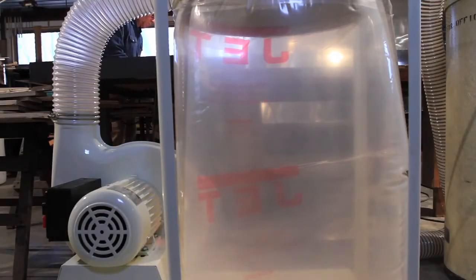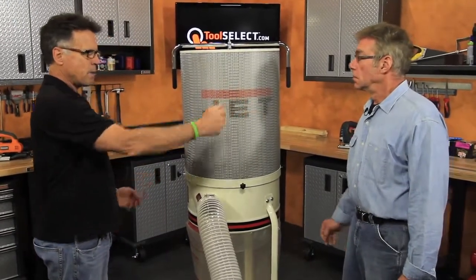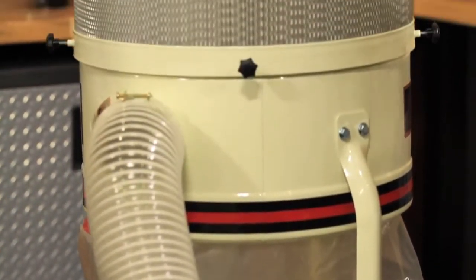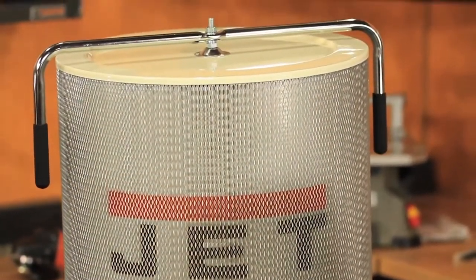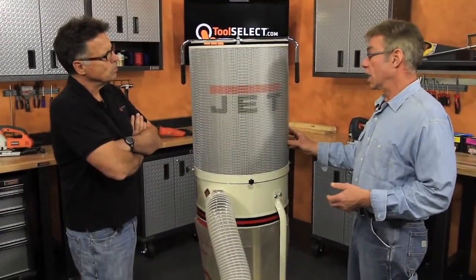Yeah. Well, let's talk about dust collection. Is this radical new technology versus the cloth bag? Well, yeah, it's a heck of a lot better idea. The cloth bags can't trap everything because it's just a weave. So I wanted to see, is there really much difference between having this canister with this pleated filter as opposed to fabric? And there was a heck of a difference.